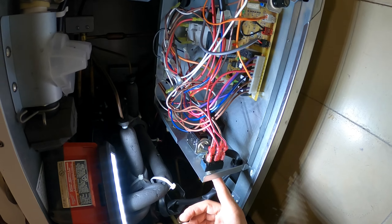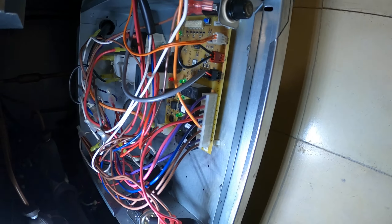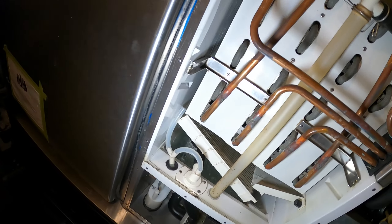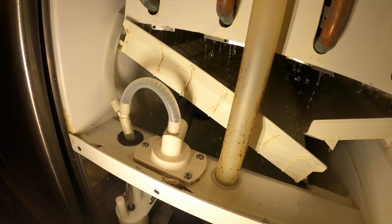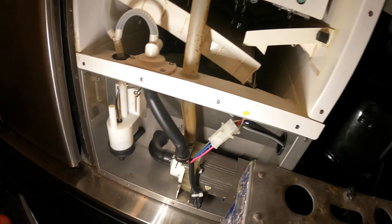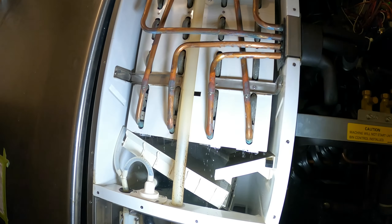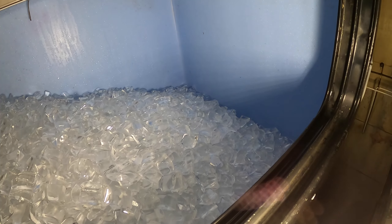Basically anything could be wrong - that's a lot of things. Let's put it in ice mode. The alarm reset is on the top left of the board - let's click that. Right away I hear water passing through - I heard the solenoid valve open. There could be some sort of water flow issue. I see right here a little bit of water coming down - I wonder if we're just losing water. It goes through a fill cycle, has to fill up the tank first. If this thing runs for half an hour and keeps losing that drip, it's not going to make ice.